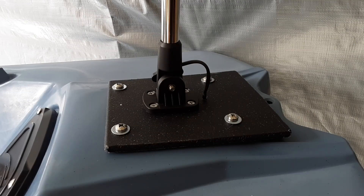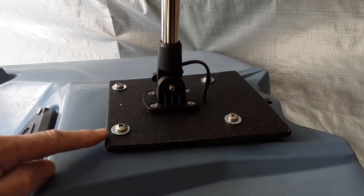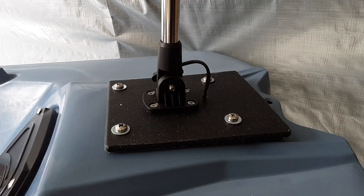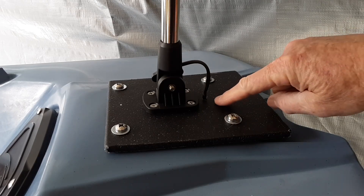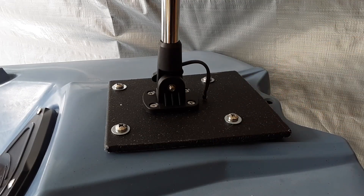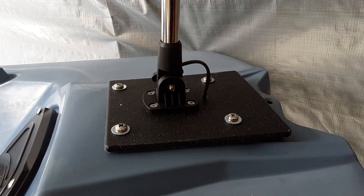This is a close-up view of the mounted base plate. As you can see I have the four screws with the washers that I used to attach the plate with the molded-in nuts on the kayak. I used four screws that went directly into the poly cutting board to attach the base of the light to this mount. I drilled a hole here to run the wiring to the underside of the plate, and I used a little bit of shrink tubing on there just to make it look nicer.